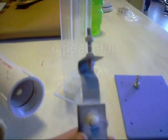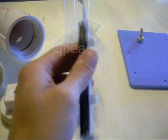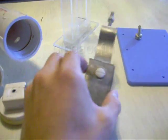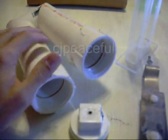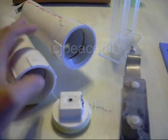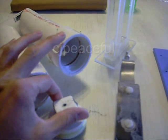These are the electrodes — flat plates, more surface area, no neutral plates. These are all tied together in stainless steel washers. Again, that produced quite well. I was able to get 250 milliliters of hydrogen-only gas in about two minutes and two seconds.